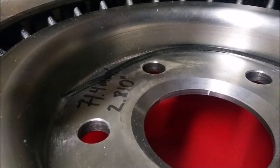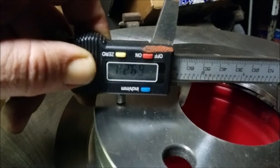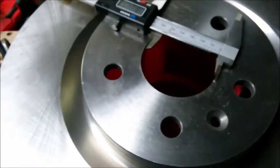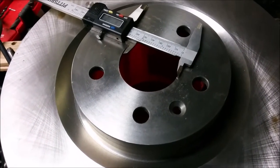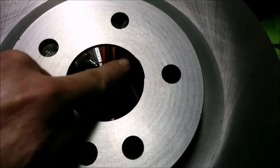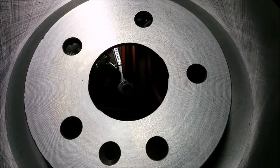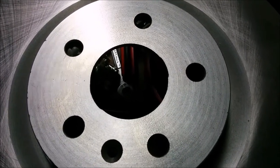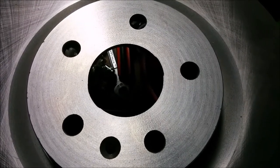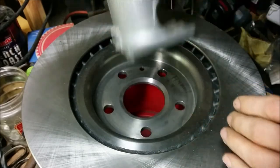You can see what it took out — pretty good. I'll do that all the way around and see how it goes. We're basically at 69.21 millimeters, so I'll do another round and take it little by little until it's big enough to start slipping the hub in. I also made a little reference cut here and there and measure to make sure I haven't gone too far with each adjustment — this one is about 70.7 millimeters, so we're zeroing in. I'm running this on the lowest speed just to be safe.